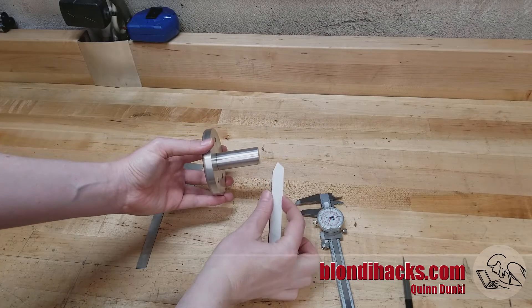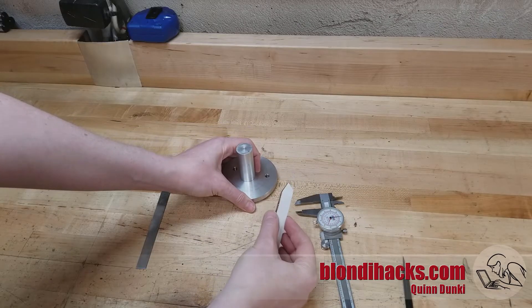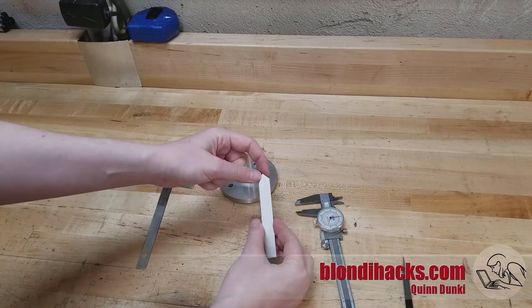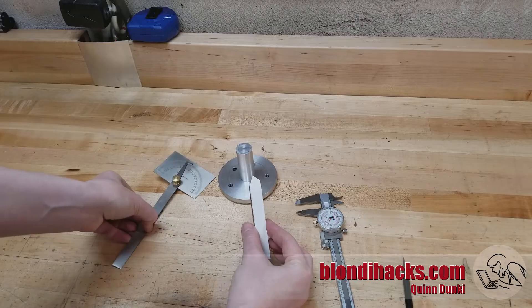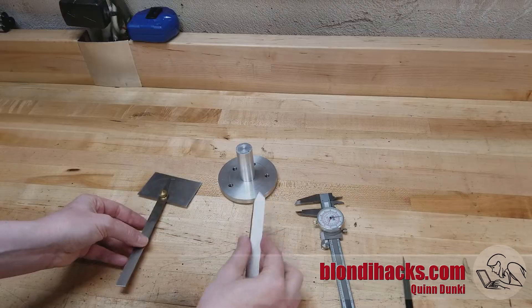You can either grind a bit with an 85-degree angle on it, or if you bought a pre-ground set say from Grizzly or a little machine shop it will have come with a bit like this. It'll look like 90 degrees but if you measure it you'll find it's actually 85. I'm going to show you how to use this bit right now.